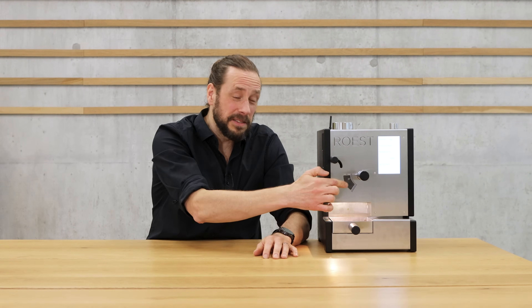On the other side of the exhaust temperature sensor is the inlet temperature sensor, which is quite popular with roasters because it gives you a very good idea of the heat entering the roasting chamber — a really nice way of optimizing your roasting process. Last but not least, there is also a sensor measuring the surface temperature of the drum, so you know how hot the roasting drum is where the beans are being moved.